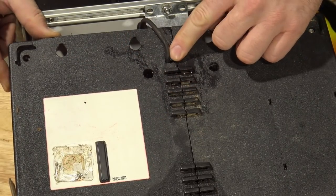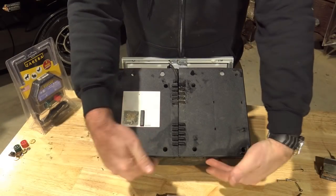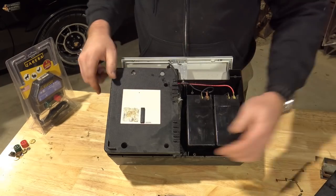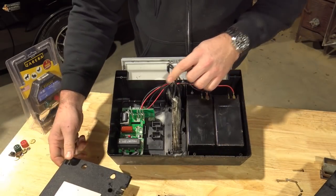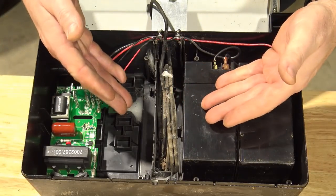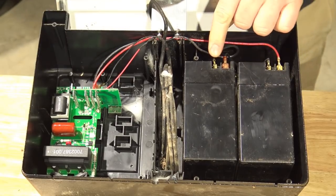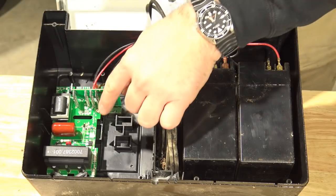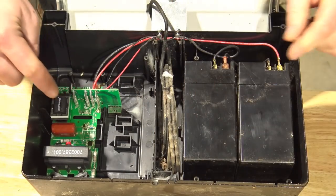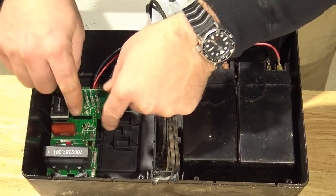Underneath here should be the battery compartment. You can see this wire right here — there's a little notch cutout for the wire, and that is the power supply from the solar panel. Don't be afraid — you're not going to hurt anything. Just pry up with your fingers and they'll come right off. This covers the batteries, this covers the circuit board. Right here is our circuit board. I took this one apart just for an example to show you how simple these are. If you're going to work on this device or replace batteries, the first thing I'd suggest is pulling off the battery terminals — they just slip right off, and tape up any exposed negatives. You can see there's a little spider's nest in there — ants had made a nest right across here and caused a short on the circuit board. You want to get this up off the ground far enough that ants can't nest inside and short your circuit board.